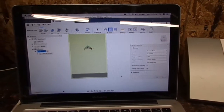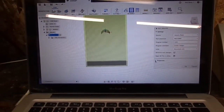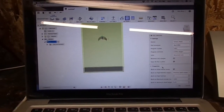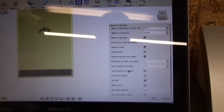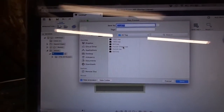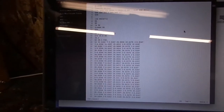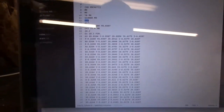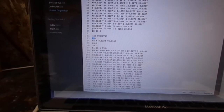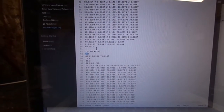I want to show the easier way to remove the G28 instead of manually editing the code. When you do your post process in Fusion on a Mac, go to Properties — on Windows a second window comes up. Scroll down the list to 'G28 safe retracts,' uncheck that, and hit OK. Be careful when you do this because it's there to help you, but if you know you don't want it, when the code comes up you can scroll down to G55 and confirm there is no G28 before the next fixture offset.